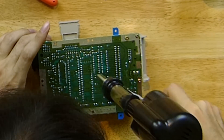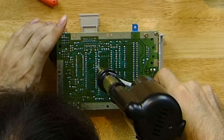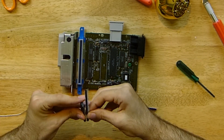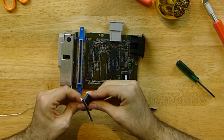Make sure all the pins are free and never pull hard on the chips — you don't want to rip off any of the board's vias or traces. Also, make sure you don't use the soldering gun for too long; you don't want to heat-damage the chips. Next, put the sockets on the chip, cut them to length, then place the chip back onto the board and solder down all the pins. Repeat for the other chip.